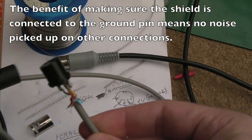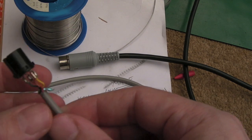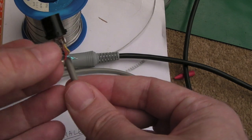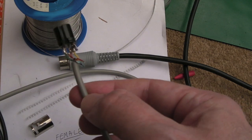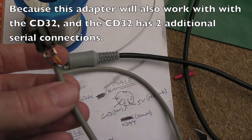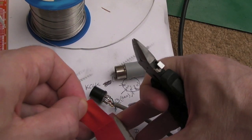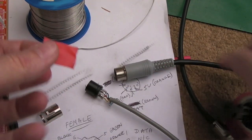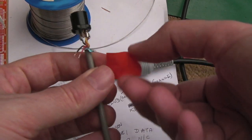That's literally taken about two minutes — it's hardly anything, just four wires. These two unused wires I could just trim off, but I might adapt this at some point so they can be tapped off to have a serial fly lead. For now, I'll just wrap a little bit of insulation tape around them to keep them isolated. You could also use heat shrink.